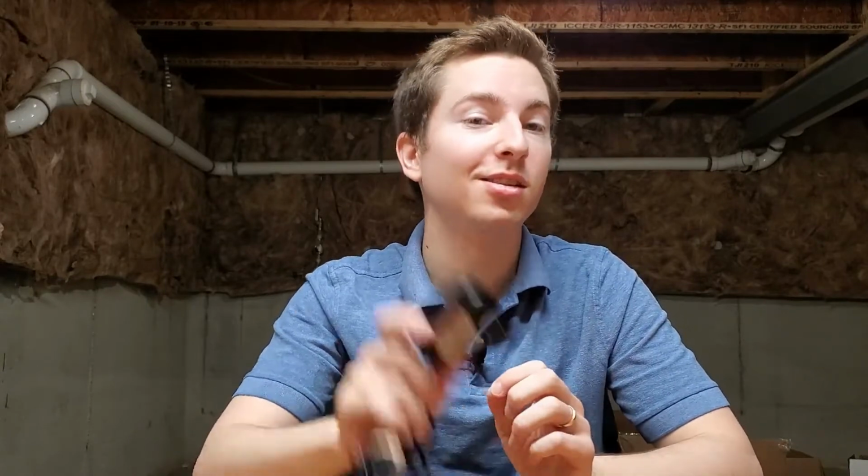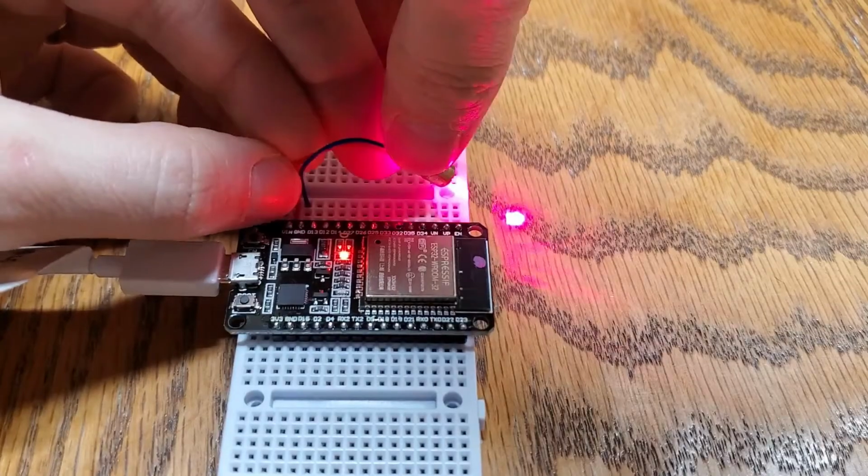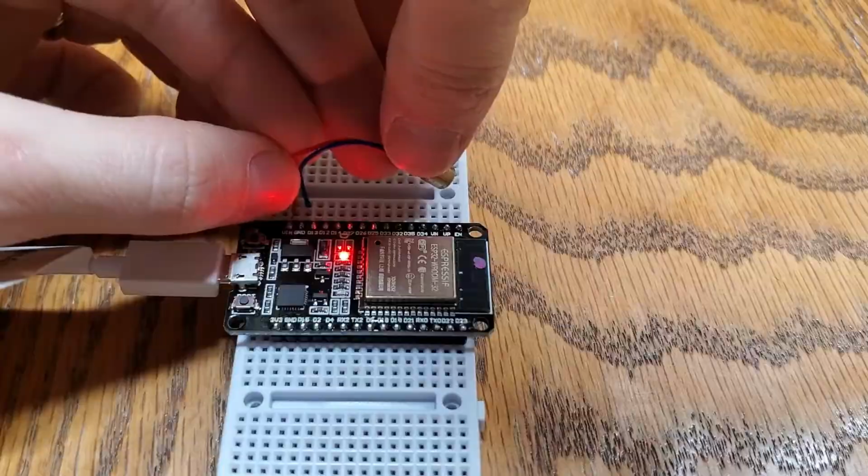To finish the code, I need a working circuit. The linchpin of any good electronics project is electricity. My experiments to power my Roomba with the power of friendship didn't pan out. This laser diode is pretty much just an LED. This one specifically does have a resistor in line with it, so you're not going to blow it up by putting it directly across 5 volts.